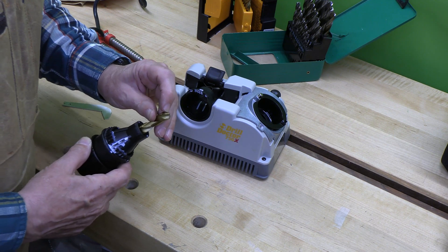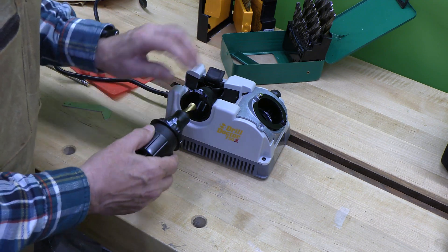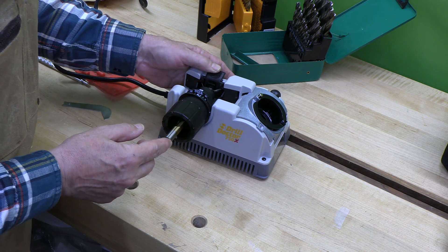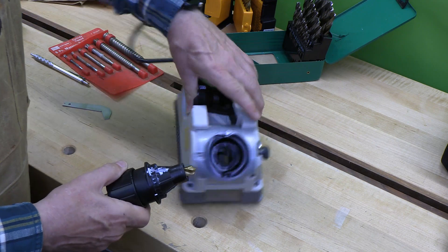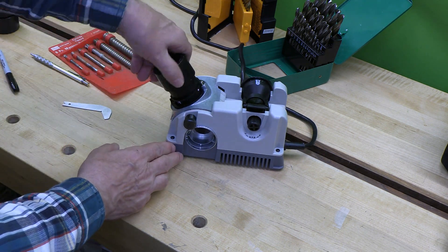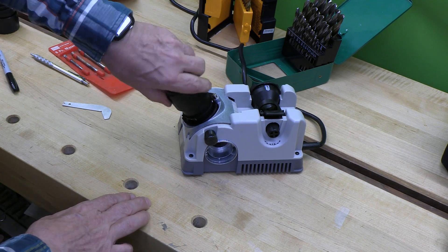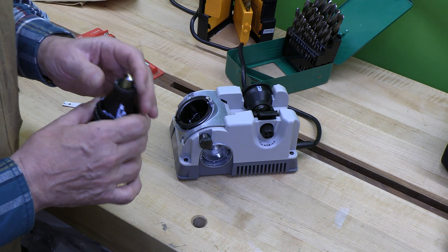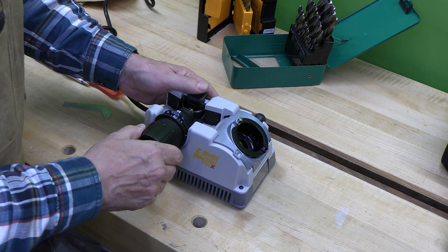We can also sharpen titanium-coated drill bits — it's not pure titanium, it's only a coating. The titanium is important right at the cutting edge and in the flutes where it helps with chip ejection. I have it loosely held in the chuck, line up this tab with the 118-degree mark, open the pawls, let it fit in there, be sure the bit is all the way against that bolt, and then the pawls will grab the tip and orient it properly. Tighten it a little bit, then really tighten it, and let's start sharpening. Let's take a look — it's not quite enough, so we're going to reset the bit at 118 and take off a little more material.